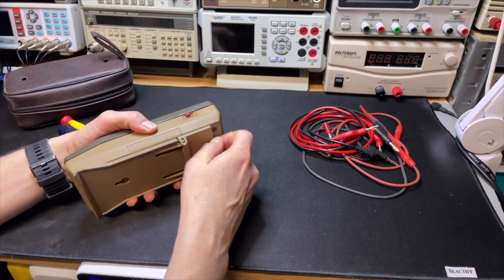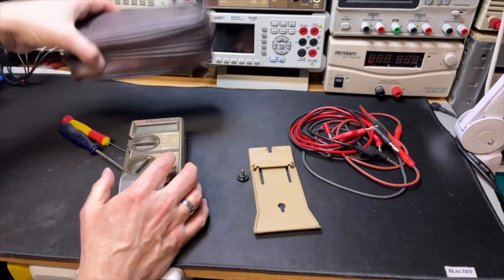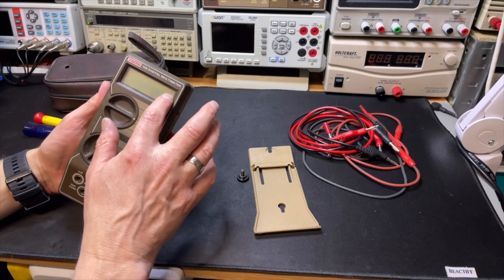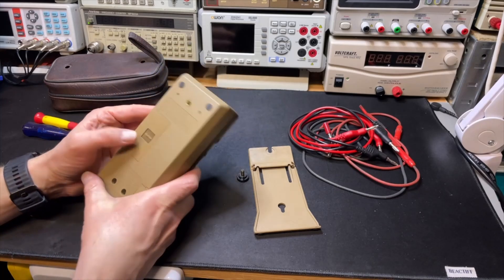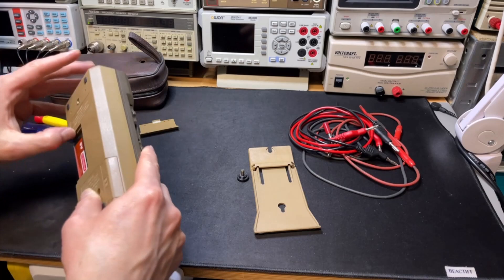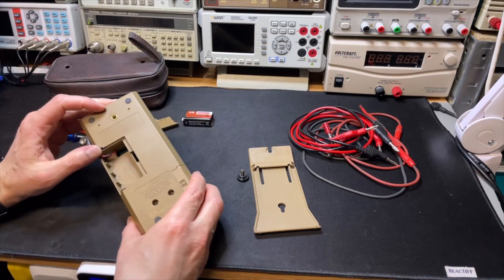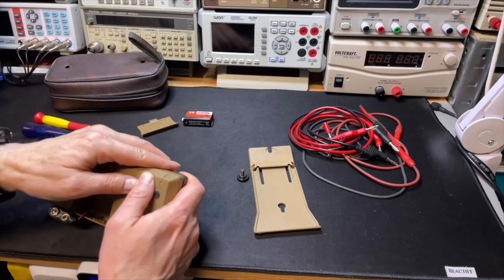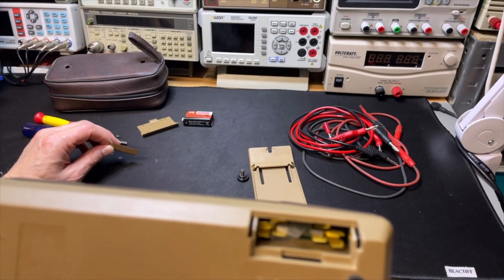I also found an option list. This meter was from the early 80s, like '82, and the soft case was an option - so I really think it belongs with the Keithley. The display is a bit tricky because it has zebra strips, and if you take the PCB out it immediately falls out. Here is the serial number. Here is the fuse - you can fit a small or a big one depending on which clips you use. That's smart.